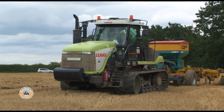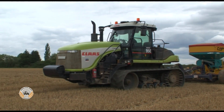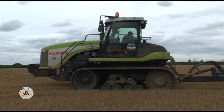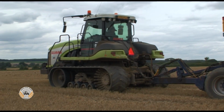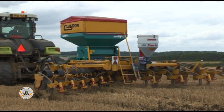A rubber-coated drive wheel was standard equipment, but a steel drive wheel was available as an option, as fitted to this 95E, and coped better in wet operating conditions. Standard belt width was 27.5 inches, but widths up to 35 inches were also offered.